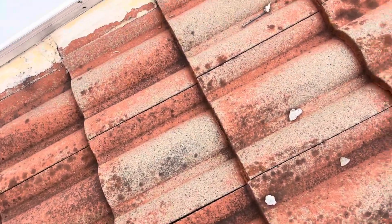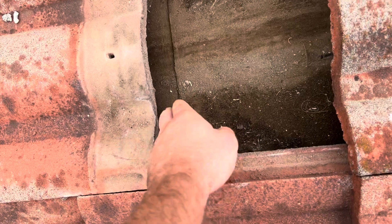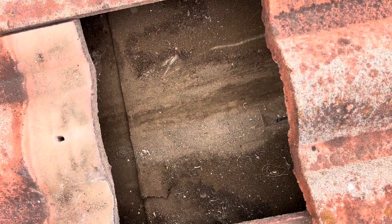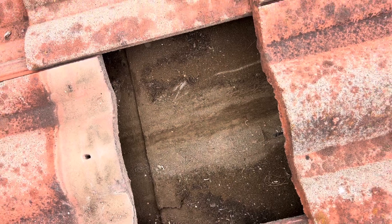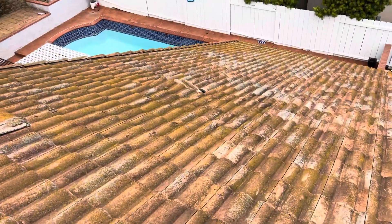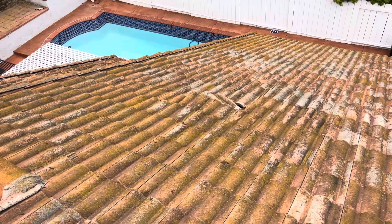Getting down here we can see probably the oldest paper on this roof. I can see the deterioration right there — that's not doing its job anymore. It definitely has passed its life expectancy and needs to be replaced. This back tile doesn't even have a nail in it.